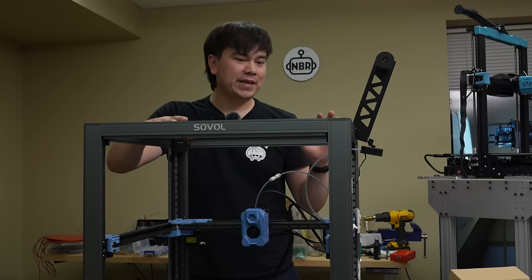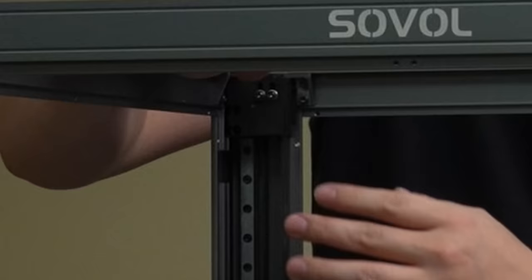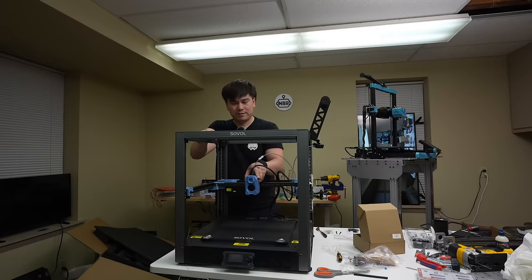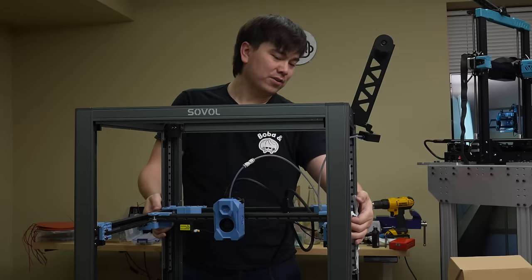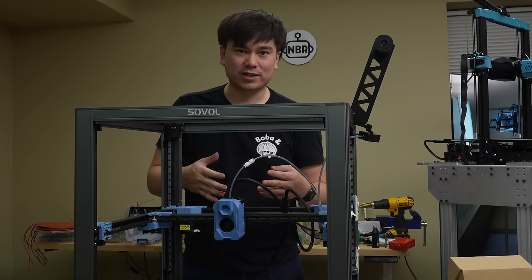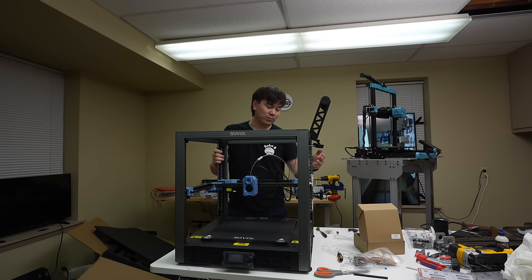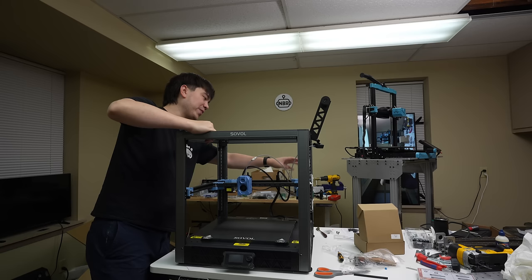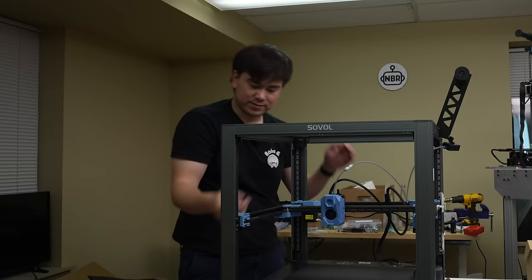All of the motion systems are using linear rails — relatively skinny, maybe MGN9s or MGN12s — and it slides around pretty nicely. The rest of the machine is made out of injection molded plastic, which isn't the strongest material, but it is good at being cheap — low cost construction that lets you hit a lower price point. One of the most impressive things about this machine is how big it is and the fact that it's a Core XY machine designed for high speeds. The spool holder being on the right side, rather than behind the machine like Bambu Lab, is a much more user-friendly location.